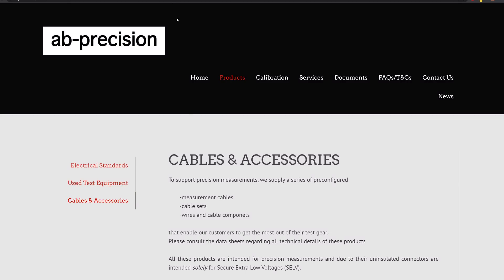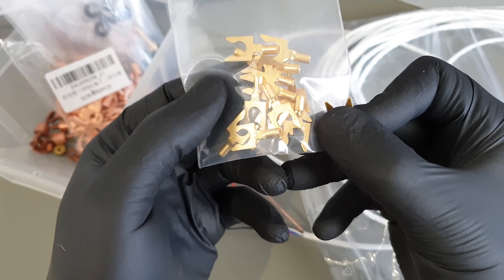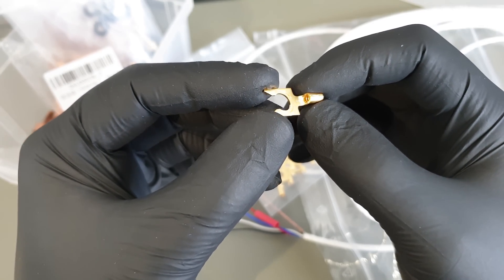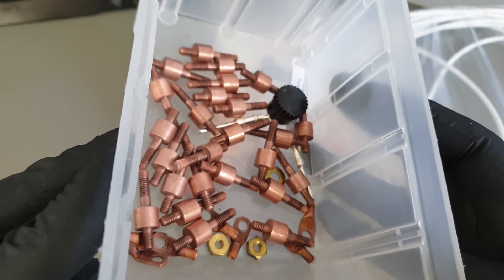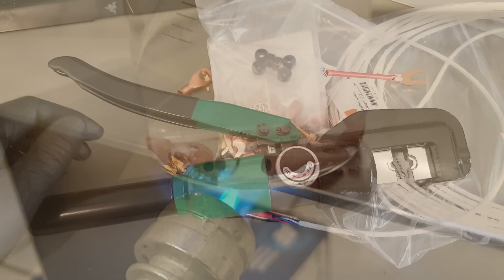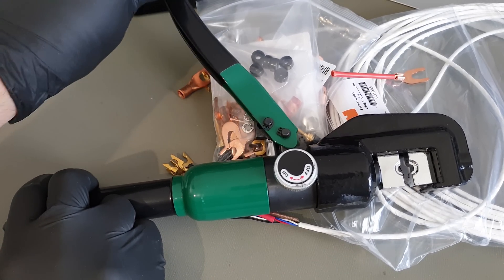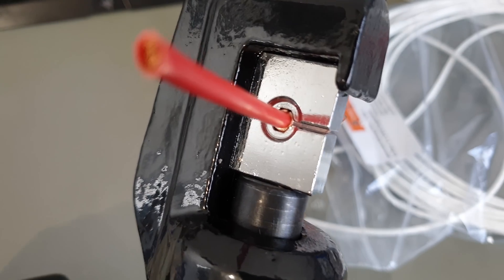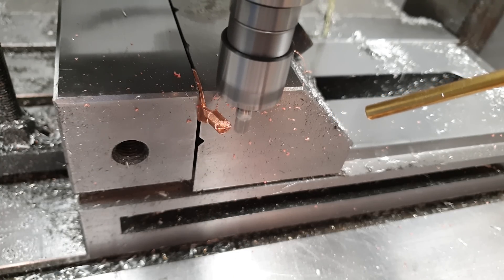A real metrology-grade test lead has solid copper spade lugs, which are naturally nowhere to be found. Except I just discovered this German supplier who's also selling other interesting cables and accessories, and naturally I couldn't resist purchasing a set of 20. They're a little bit expensive, but they tick many boxes — made for small cable diameters, not a lot of thermal mass, so they adapt to temperature changes rapidly. Before discovering these I tried many alternatives, and based on the fact that the most promising results came from boiling regular tinned copper lugs in hydrochloric acid, one can tell that none of them are viable. Very viable though, for many tasks other than low-thermal EMF connectors, is a hydraulic crimping press. This makes it easy to apply enough squeeze to a crimp to deform the individual wires and almost cold-weld them together. The press cost about as much as 20 of those nice spade connectors — very happy with both purchases.